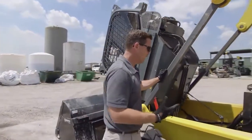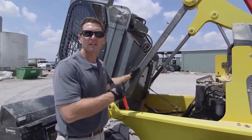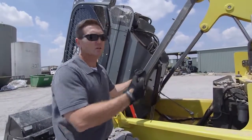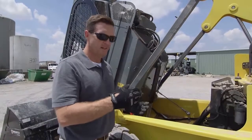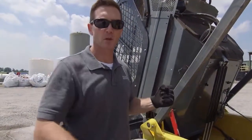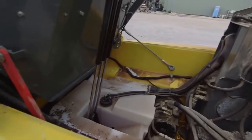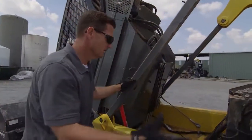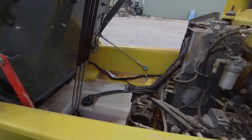Probably the most impressive feature of the Wacker Neuson skid steer is that we are still a pilot-controlled system. Most competitors in the marketplace are electric over hydraulic, meaning a joystick electrical signal goes to a relay, which then tells the hydraulic system what to do. With pilot control, we use low-pressure oil to push high-pressure oil, eliminating all those additional wires and wiring harnesses from the machine. As everyone knows, electricity is not a strength in the fertilizer industry — and you can see how open and clean our machine is because we don't have all those extra electrical wires.